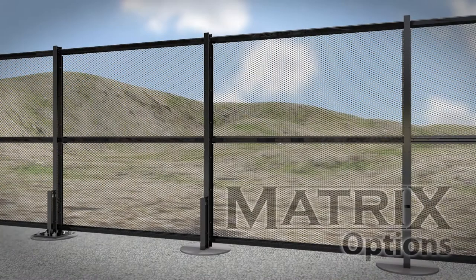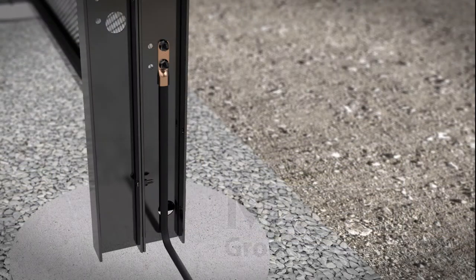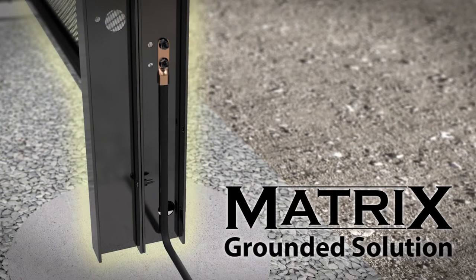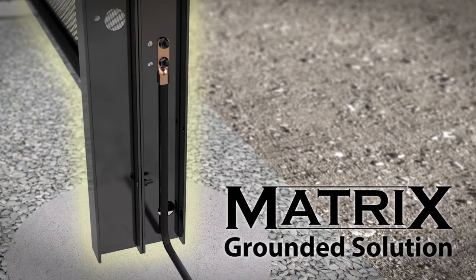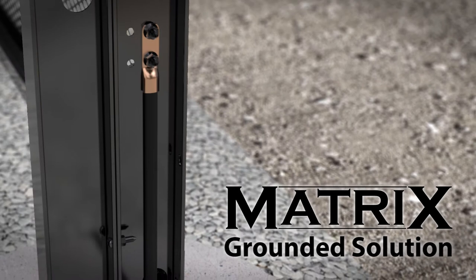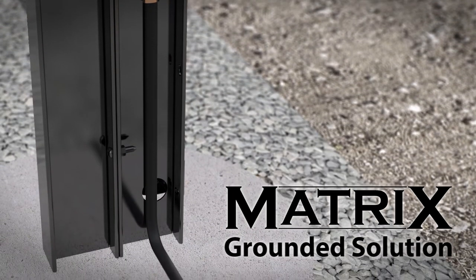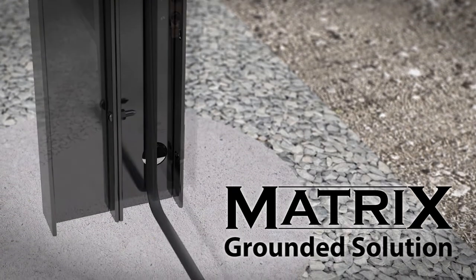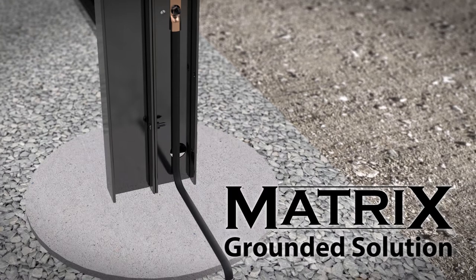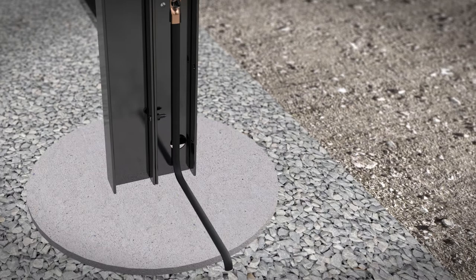As an engineered solution, Matrix features several easy-to-install options. Matrix is the first coated system designed to minimize system impedance to comply with IEEE grounding requirements. No additional grounding material beyond the structure grounding lug installation is required to create a low resistance and safe fence system. By way of fence construction, the entire Matrix system is inherently grounded without the need for any additional work. Grounding location at the post is for taking the fence system to site ground.